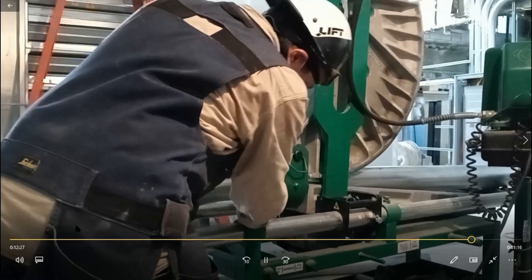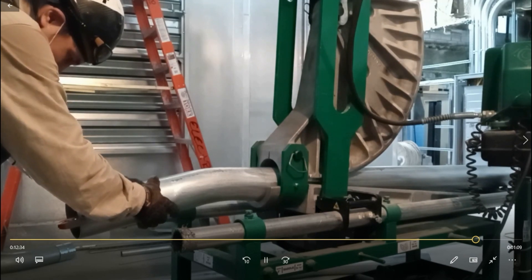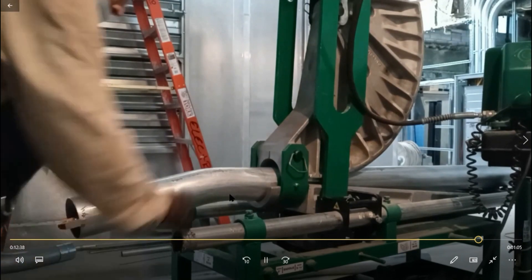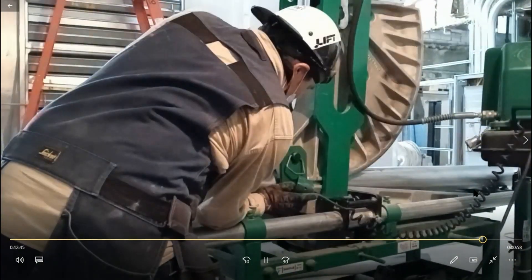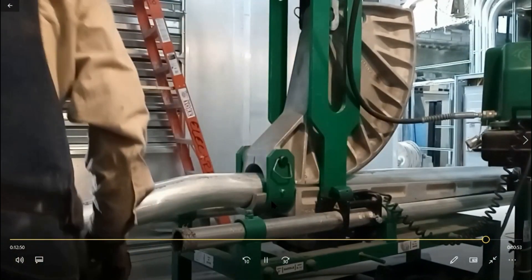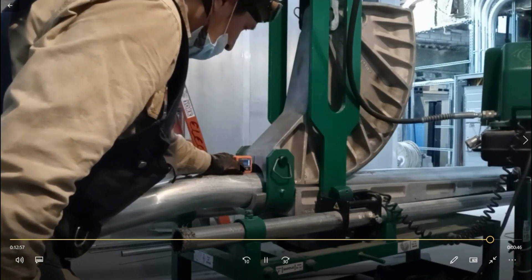With the no-dog, you have to actually walk up to the front of it and check it. You want to make sure that your mark is lined up with the front edge of the saddle. If for some reason when you go to lock it up or level it out it's not level on your no-dog, or you missed your mark a little bit, release it and do it again. After a while you'll know exactly how to get that mark spot on. Put the digital level on, zero it out, and you're good to go.